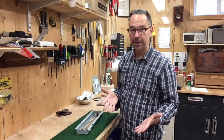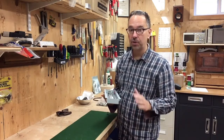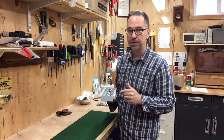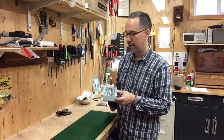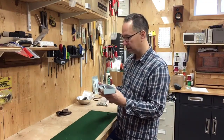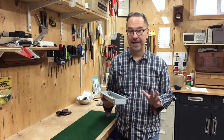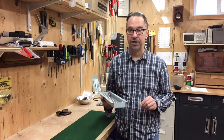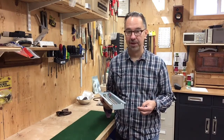Now the reverb tank requires special consideration. The reverb recovery circuit is so sensitive that it could transmit feedback through the system very easily — just mechanically, just by having it inside the back of the cabinet. There are a couple of ways to take care of that. The traditional way is to use a reverb tank bag. Mine that I had on order hasn't come in yet — it was a special order through Next Generation Guitars.